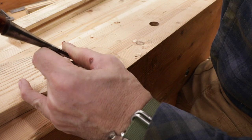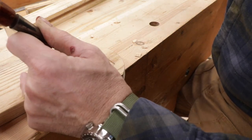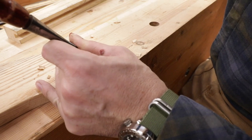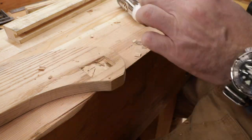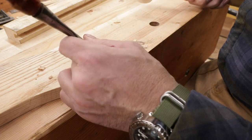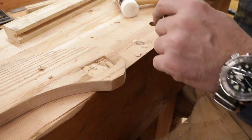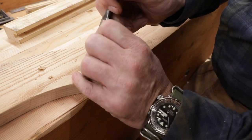My clamp's totally in the way here. That's way too deep there — I'll move that clamp. You run right into that wall — you can feel it and break that off. Then you just repeat the process: put your chisel in there and give it a good hit. Now that you're down deep and those sides are protected, you can really put some — put the Swede to it, as my granddad used to say — a strong, powerful stroke.